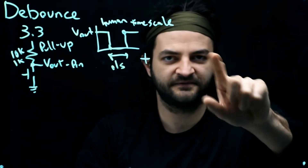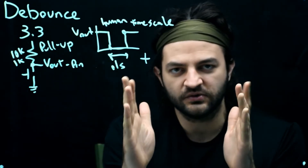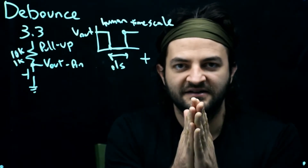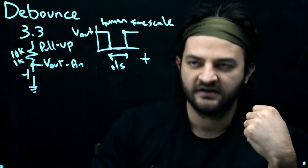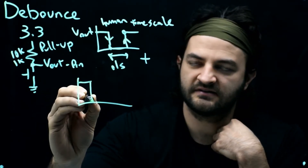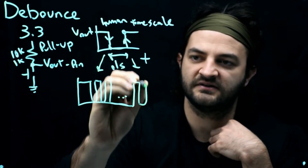But on a button time scale, there's a spring holding those two wires apart. When you push the button and compress that spring, sometimes it bounces. You think you're doing click-release, but inside it bounces. And when you release, the spring brings it back and it bounces a few times before settling. So if we zoom in on the downward or upward event, what we'd really see is: you push the button, it clicks, hits ground, bounces, comes back to 3.3V, bounces again, and eventually settles. The upward event does the same — you let go, it bounces, and eventually settles.